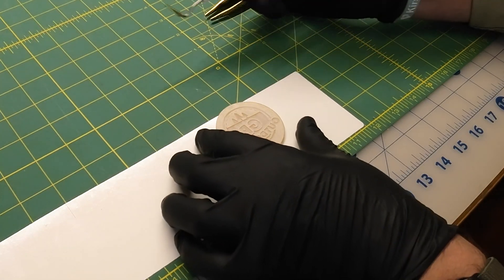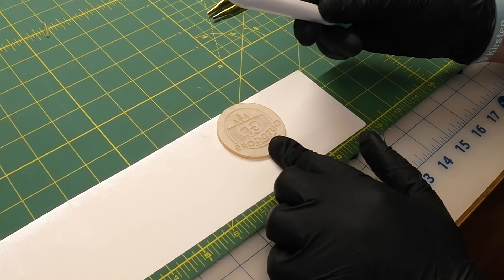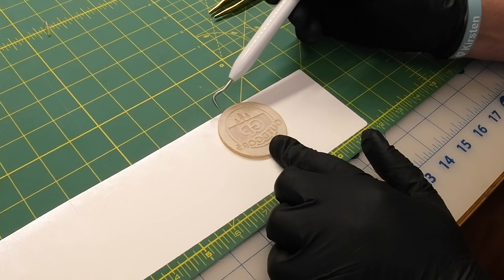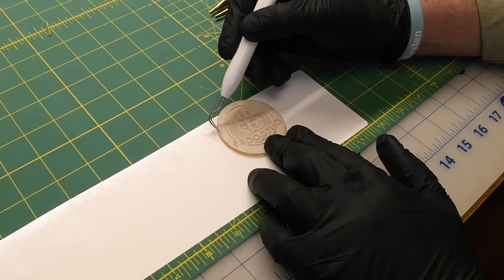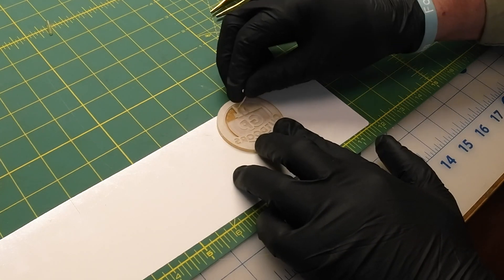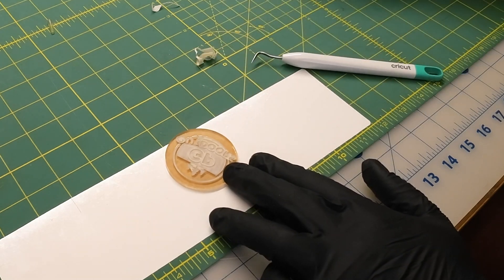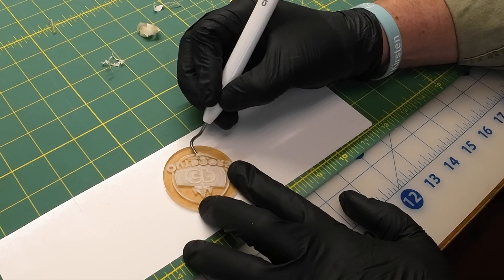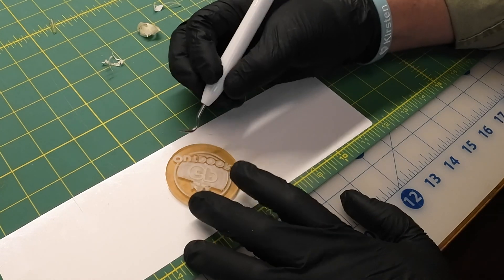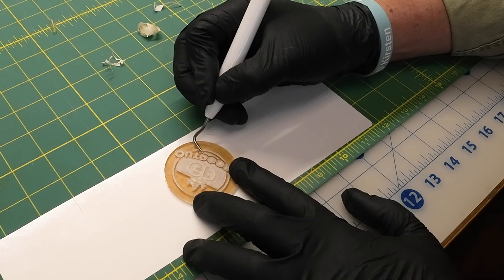Okay, let's clean this up. I'd highly recommend, because of how sensitive this acrylic is, that when you're using the pick tool, use it very carefully and try to use more of the side or the rounded part of it once you try to get a piece, so that you don't scratch it. It can be a tedious process, but it is far easier and far cleaner than trying to clean that residue off that ends up melting to the top of the acrylic.